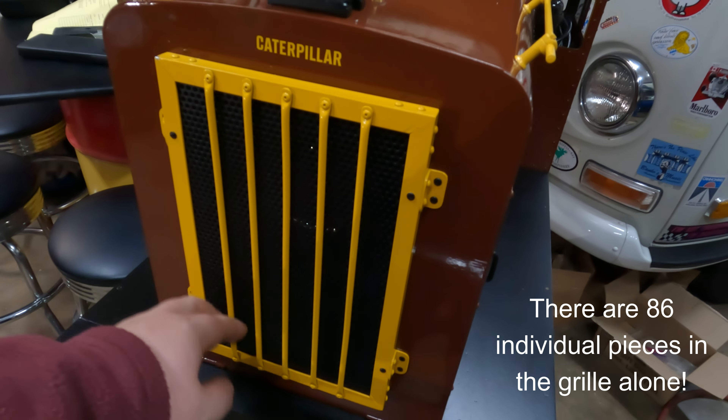You can see the side rods down at the bottom. If you're building your first locomotive, I can't say I'd recommend going with side rods — they can be a pain to figure out and get going. These ones have done pretty well, though they have a pretty loose fit. Much looser than you would want on a steam locomotive, just because my quarters aren't perfectly centered. Keep in mind I made all of this without a lathe or milling machine. The side rods have a little slop on them to compensate for some discrepancies — maybe the frame isn't perfectly square — and it seems to keep them pretty quiet.